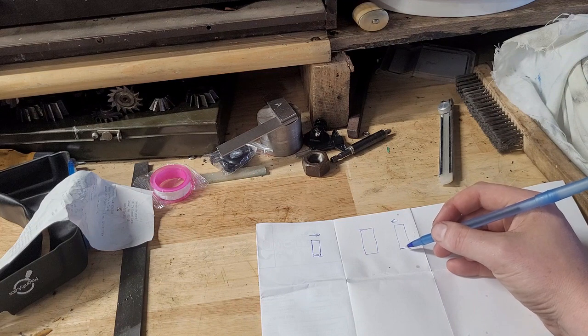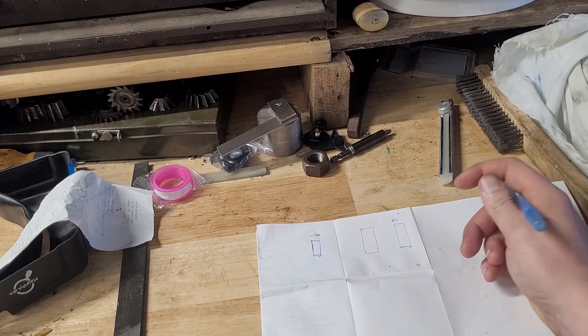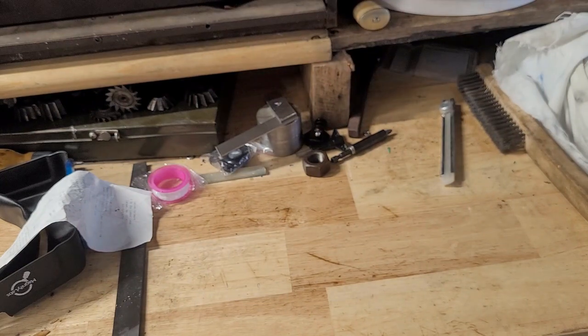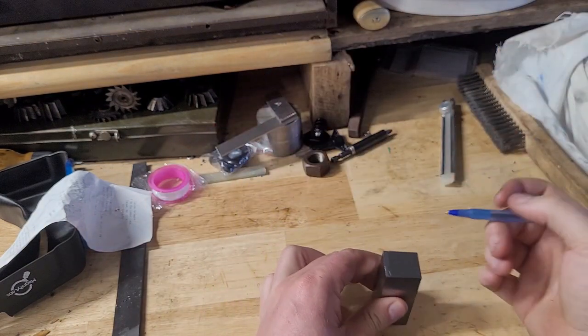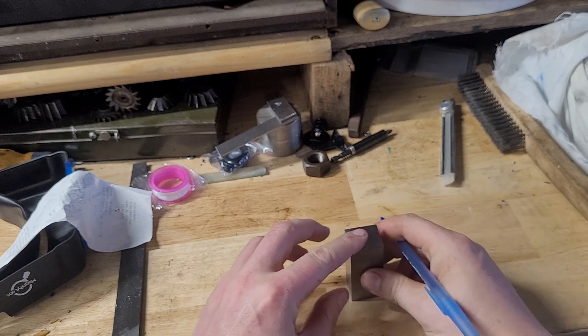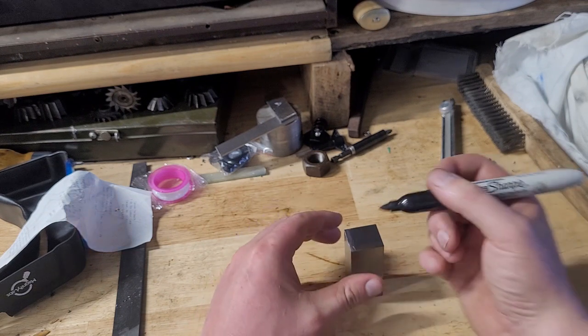It's also technically called step grinding, I think, because there's a step here. I can illustrate it on one of these parts. I've already done this on the grinder, and you also see I haven't fully cleaned up this face because this is over length by quite a bit, because the goal was to grind them square. Now, I'm not a great grinder hand, so I try to give myself between 20 to 80 thousandths of an inch to correct for. I'd rather take extra time making it perfect than have to remake the whole part.